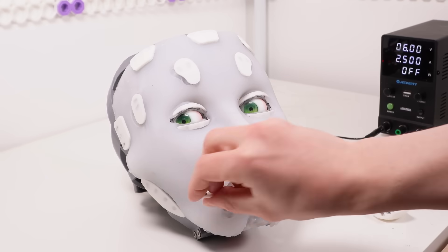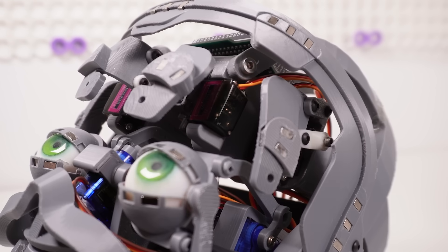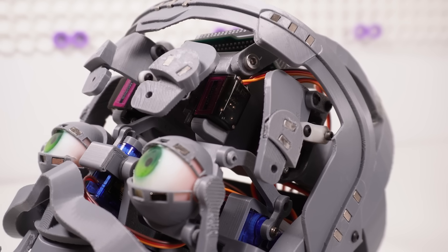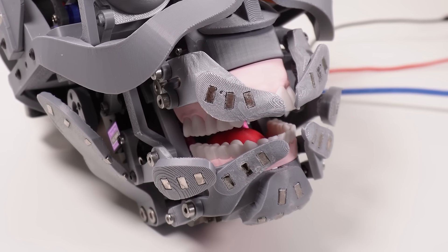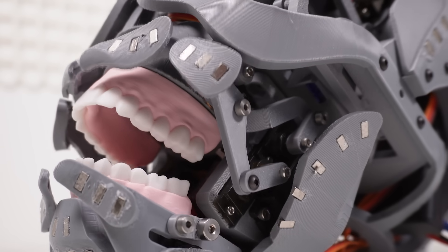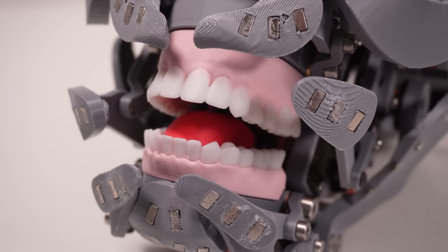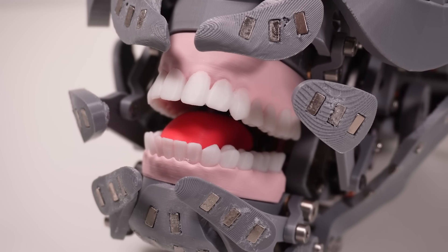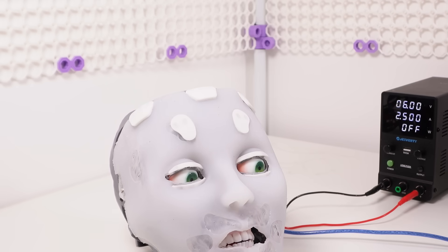To make this easy to assemble, modify, and test, I made these magnetic panels to act as anchors to pin the silicone skin in place at the main interaction points of the mechanisms underneath. This included two points per brow, giving me shocked, angry, or sympathetic expressions with a simple linear motion. The lips are more complex, with two pairs of up-and-down linear motions for the main bulk of the lips, and mouth corners which work by coordinating motion between two pairs of motors, letting me move anywhere on a plane perpendicular to the motors' rotation axis. New in this version is a tongue, which is pretty important in speech and gives a visual difference between how a T looks versus how an R looks. There are also attachment panels around the edges of the silicone skin.